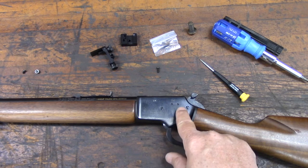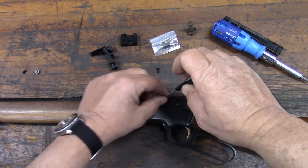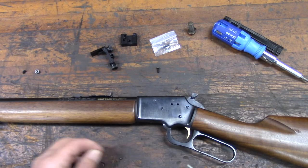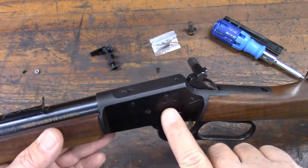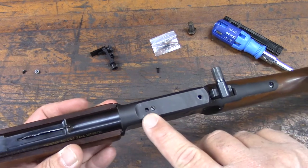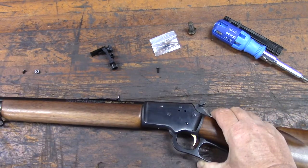Now we'll go ahead and remove these two filler screws — they should unscrew fairly easily. They're tiny little things, so be careful not to lose them. Neither of them was terribly tight. The sight is going to overhang this hole, so I'm going to have to remove the elevation slide from it again in the future. But I don't want to wait a week or two until I can get filler screws to do this, so we're just going to proceed without worrying about those filler screw holes for the moment.